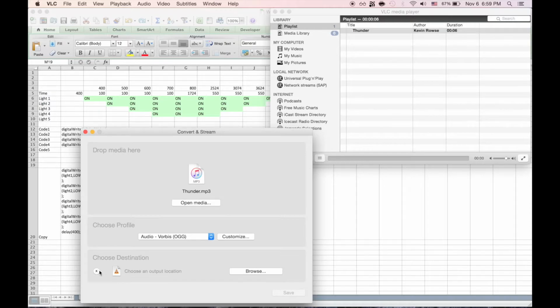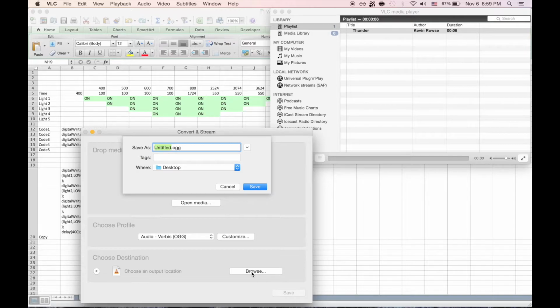And then you'll want to select Save As File, Browse, and then the naming convention is T0, and then depending on which pin you want this sound to play. So if I want to play this sound when pin 1 is activated, I'll do T01. If I want it to play when I activate pin 2, T02. And respectively, and they've got a lot more information on their data sheet if you want to get into more advanced triggering, but that's pretty much about how easy it is. And then you'll just click save and upload it to the soundboard and you're good to go.